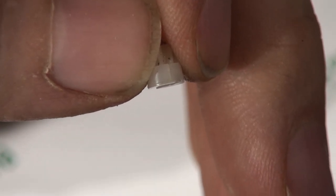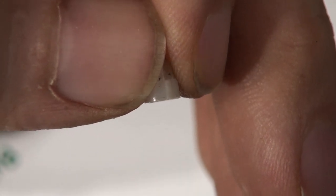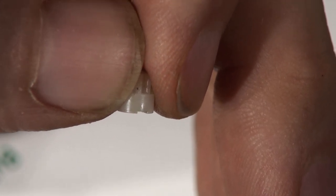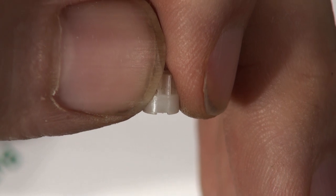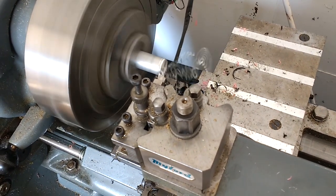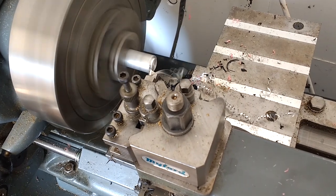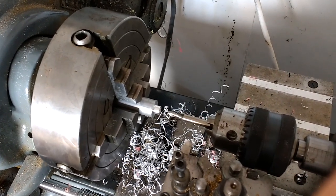Let's see if we can fix it. I'll find out if the gear is available separately; it may be a standard gear. I've had about five or six calls in six weeks about this same problem, so it may be significant. I'm now turning up a sleeve to go on this gear — a very tight fitting little collar to keep it gripped on the shaft and also stop it splitting further. A 3/16 inch milling bit is just about exactly the right diameter, and I'm hoping it'll be a sliding fit that expands slightly when the shaft goes in and grips it.